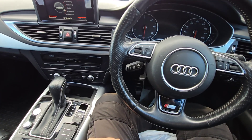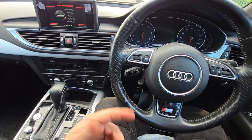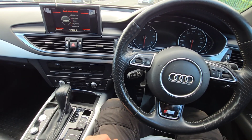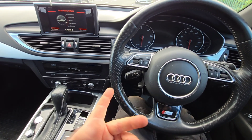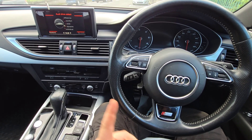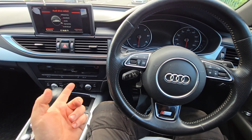I was still able to drive the car. Today, looking at the car again, I managed to erase all the fault codes. The single wire mode had changed to sporadic, so the fault was effectively gone. I just needed to do the end stops on the steering rack because that was one of the modules that was affected — it just needed the basic setting done.